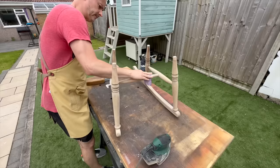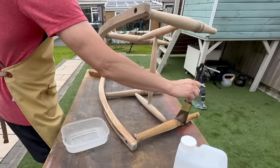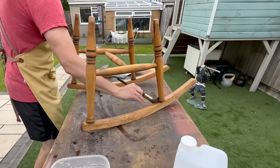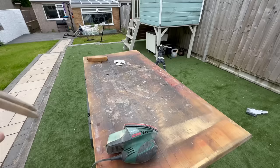When I was done with that I applied oxalic acid because there were lots of stains and weird colors in the wood - it was old and really beat up. Oxalic acid removes organic-based stains, and overall it just bleaches the wood a little bit, so that's why I used it. When it dries you need to rinse it with water to deactivate it, and also because if you sand it dry it can be quite dangerous to inhale.